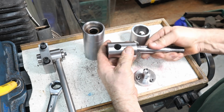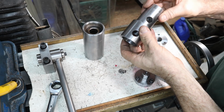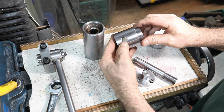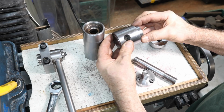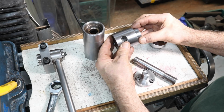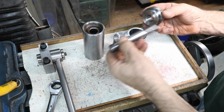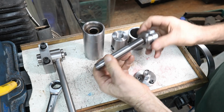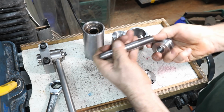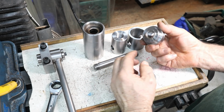And this is going to screw in there. We're going to lock that together. Then this piece here, which I call the tube rotator, slips over this, and the slide bar goes through. As you pull on this, this pulls against the tube, it won't move, and then this just pulls and snugs it tight. Then we have the drawbar nut. It goes on the long part of the thread here. That goes real good, and that will draw the draw plug tight when we screw that in.